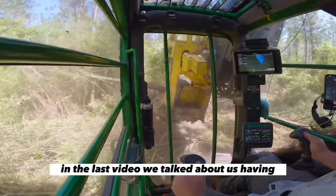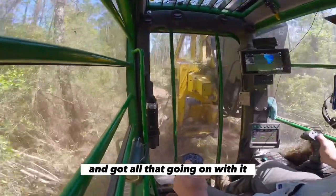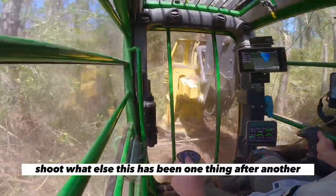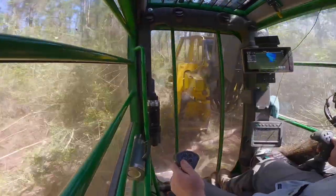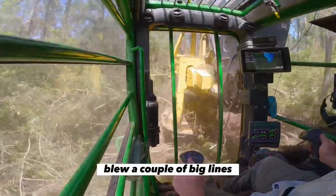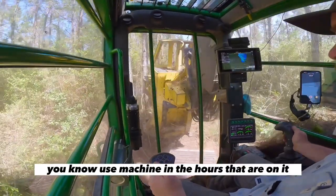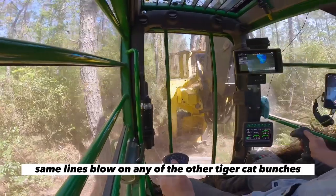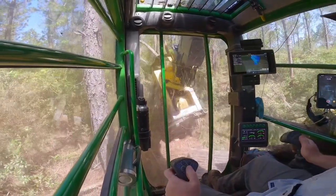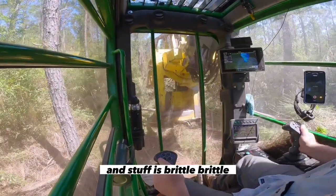I think in the last video we talked about us finally purchasing a log truck, and got all that going on with it. What else? It's been one thing after another. The new 724 that we bought, y'all saw the last video on, it blew a couple of big lines in it. That's just common with it being a used machine, and the hours that are on it, those particular lines, same lines blow on any of the other Tigercat bunchers I've ever ran in about the same hour time frame. So we got that taken care of. This stuff is brittle.